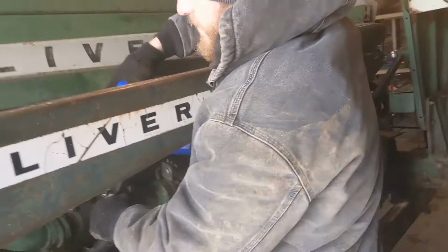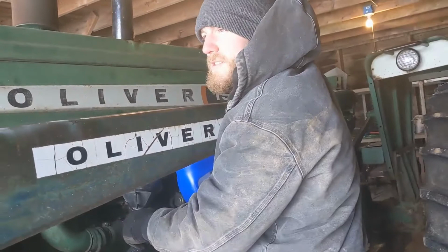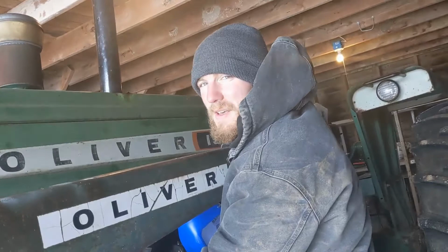So now that I have time here waiting for this oil to make its way down in there to this funnel, on this tractor today, we're going to change the oil, which we're doing. And then I also want to change the hydraulic oil. Last time I had it out plowing snow, the hydraulics were kind of slow on me, and I think there's a lot of water in the system. It's got that milky look to it when I checked it. So we're going to try to drain that out the best we can and put some new hydraulic in, especially before this big snow we have tonight.